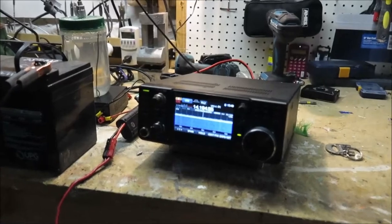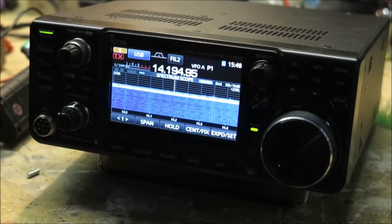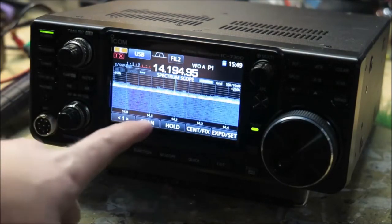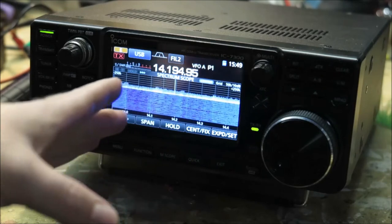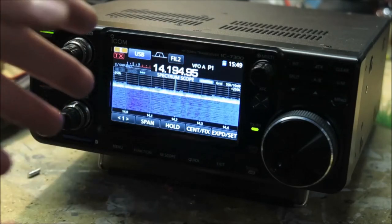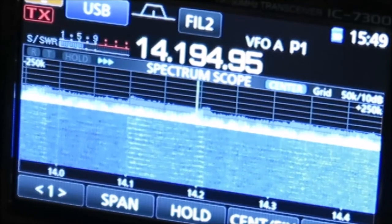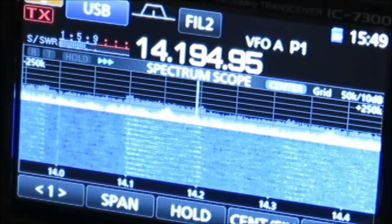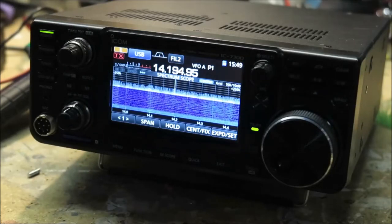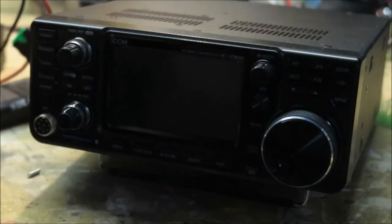I still notice quite a bit of RFI but that's probably from my house. If that was the battery, here is the new HP server-grade power supply. There is this unusual wideband hash on a particular frequency that seems to be falling downward, but it wasn't nearly as annoying as the comb from the Radio Shack supply. I placed the dummy load directly on top of the HP server-grade power supply and you do see quite a bit of noise — it looks like it's scanning back and forth — but if I move it away it's almost completely gone. Switching back to the battery, look how much cleaner the signal is.